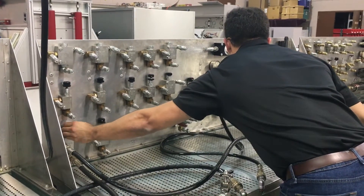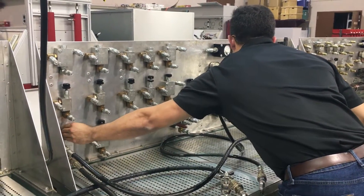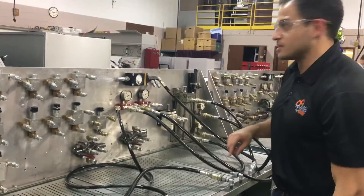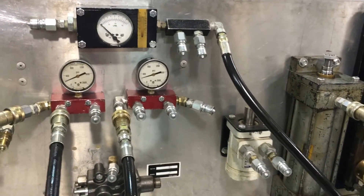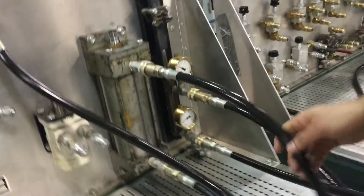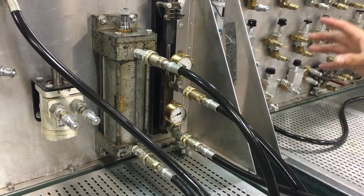That's not working. Now it's at 200 psi, and basically what we're doing here is we are going into our cap end area of our first cylinder connected to our gauge which is reading 200 psi. Then we have our rod end area going to our second gauge.